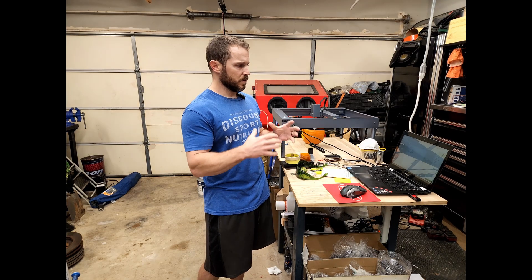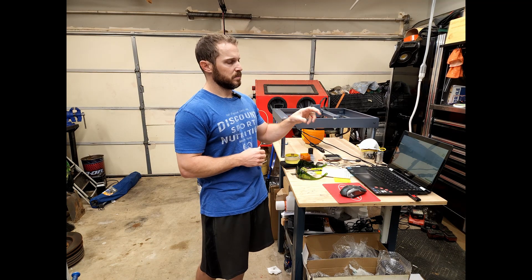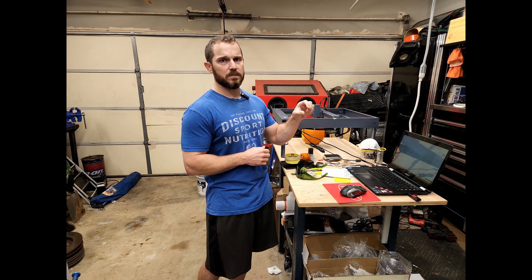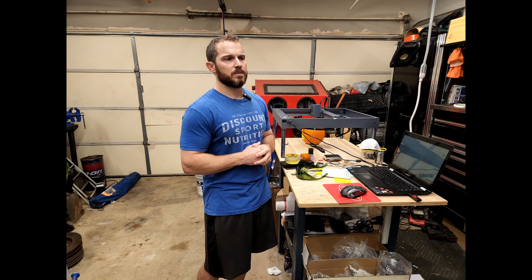Using the curvature, I'm going to likely be engraving or cutting and then I'll do two passes, then lower the laser module a little bit and then do two more passes, and then keep lowering it and running it until it gets all the way through. If I get through on some spots and not others, I may go in with a blade and touch up, trim some of that stuff out of there afterwards instead of keep on cutting with the laser.